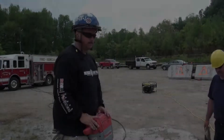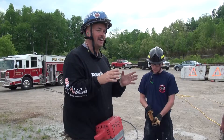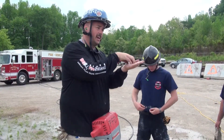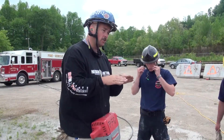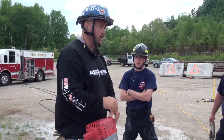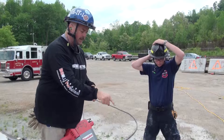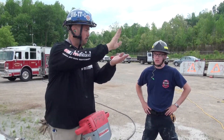When talking about breaking concrete, people think it's just brute force — it's not that hard. The problem is there is a technique. Concrete is very hard in compression — that's how it's designed. Concrete is very weak in shear — when something's not underneath it, it's very easy to break that way. When we start chipping concrete out, we're trying to gain shear. If I just take this hammer and set it right in the middle, I can chip and chip and not do anything. I want to start it down into it and then lay the hammer back as far as I can — that attacks the concrete in shear. The hardest piece is the first piece because the concrete has nowhere to expand — after that, just start popping them up.